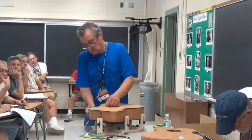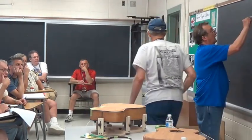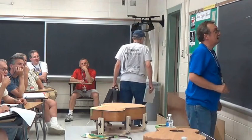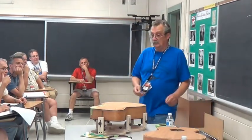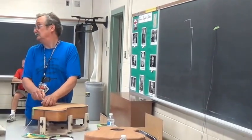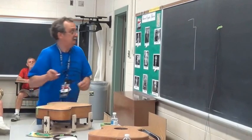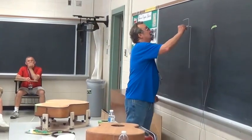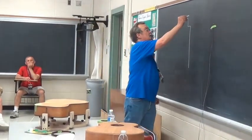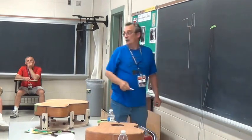And I would also like to know, how many guys use wood binding? Okay, if you use wood binding, we got trouble. As a machinist, I can tell you, you never get a good inside corner. No matter how fresh your bit is, there's always going to be a little bit of a problem there. So you take your wood binding, and on the inside, you want to break that corner.